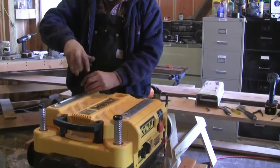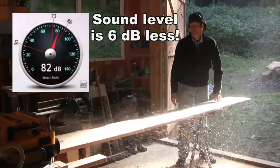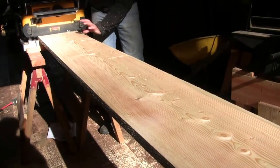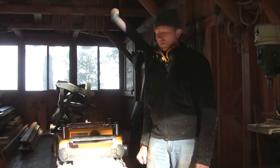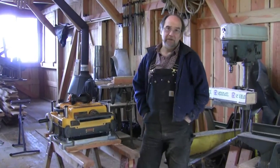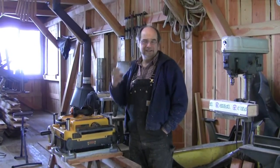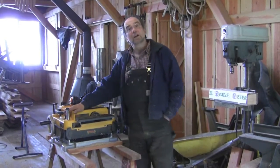We're ready to fire her up. Several differences — it makes for a very smooth cut, and it's actually a little bit wider too, because previously we'd always get a little bit of a ridge. The sound is just smooth as butter and it doesn't slow down nearly as much. We now have a cutter head that is significantly better than the previous stock model — it produces a wonderful finish on the wood and is notably quieter. We're clocking five to six decibels less, which doesn't sound like a lot, but gone is the ear-splitting screaming of the previous cutter head. We're looking forward to many more hours of comfortable planing.